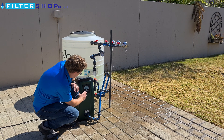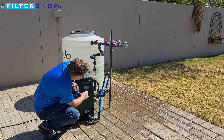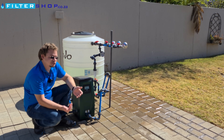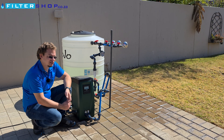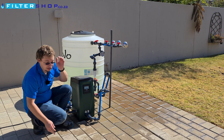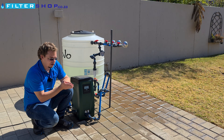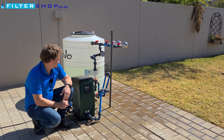So it looks like this pump has got enough capacity that you can really use it at higher pressures, but it does definitely come at the cost of power consumption. With a smaller unit you would struggle. Say if you want to use it on a system with vessels where you'd want about 2000 liters per hour at a minimum of two bar pressure, this one would be able to provide it where the EasyBox Mini is a little bit on the small side. Another thing to keep in mind with any of the DAB EasyBox pumps is the pressure controller — you can't set a bigger pressure drop. Adding a larger pressure tank doesn't really benefit you that much as you only have up to a maximum of a one bar pressure drop that you can set, so you'll only get a small amount of capacity out of any pressure tank you use.